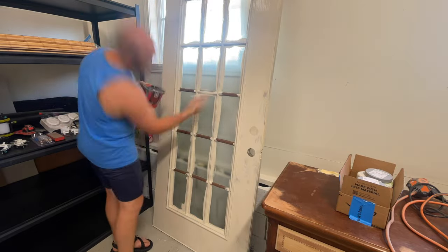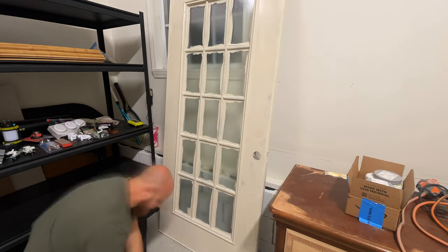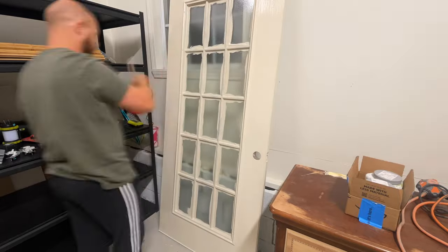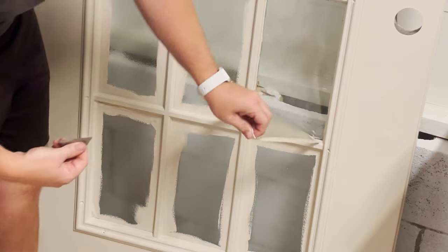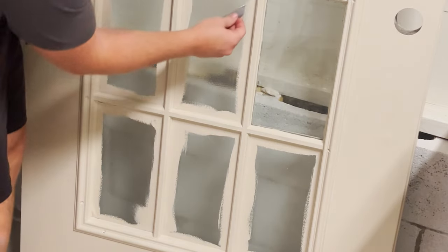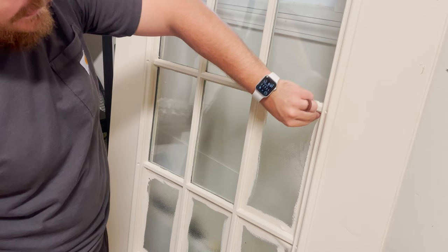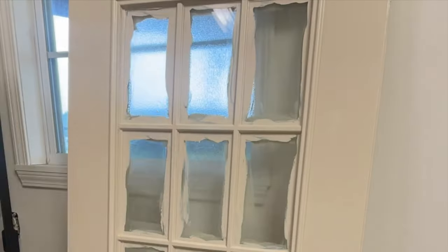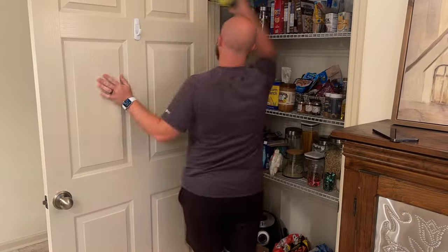Here's a tip on painting the door — I didn't actually tape off anything. It had frosted glass pieces inside and we didn't want to keep that frosted look, so I just left those in and painted over them. That really helped on the cleanup — I basically just pulled the glass off and most of the paint came with it, then used a razor blade to scrape any leftover paint. Even on a regular door with windows, I would not recommend taping. That's too much work and waste of money on tape. I just use a razor blade and scrape off the paint.